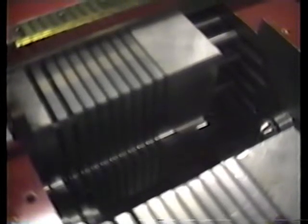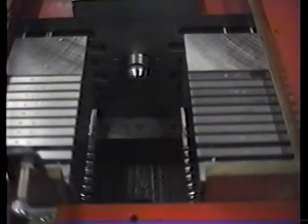This is a top view of the forming dies. These are the OD dies that surround the tube while we pressurize and collapse it. The end seal will seal one end of the tube so we can pressurize and form it. These dies are made of alloy steel. They are high precision and there is a patent pending on our positioning — the pitch positioning system that we use.